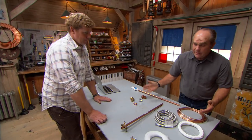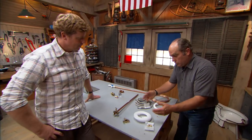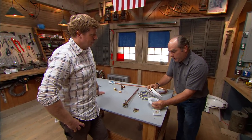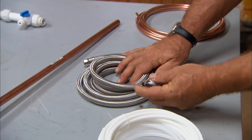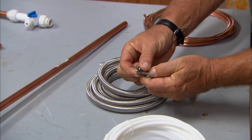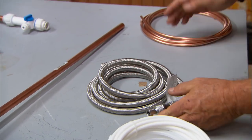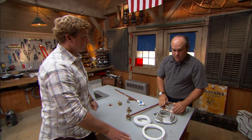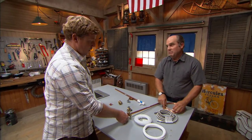So then you're going to connect to some sort of tubing - here are your choices. This is what comes in the kit, it's simple polyethylene. There's some other plastic, poly-P. This is the stainless steel braided connection - it comes with a connection that fits right onto the shutoff valve. And this is the copper, which is what I've always used and I'm most comfortable with. If I'm not going to use that, I'd use the stainless braid. The plastic you can use, but I sleep better having no saddle valve and a copper pipe.